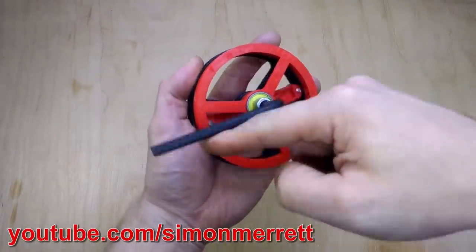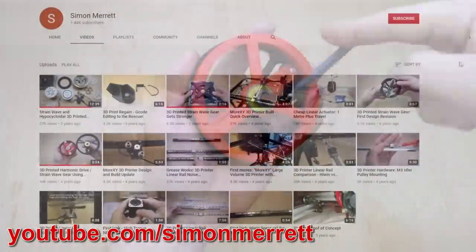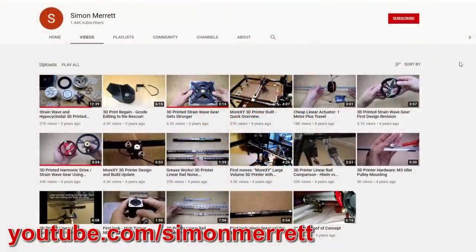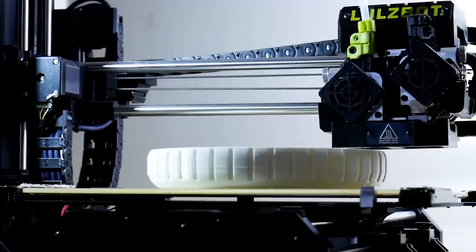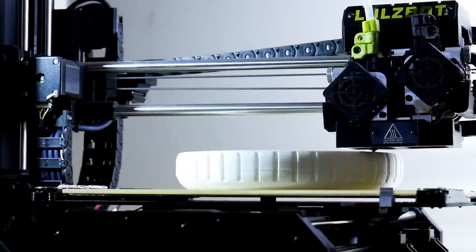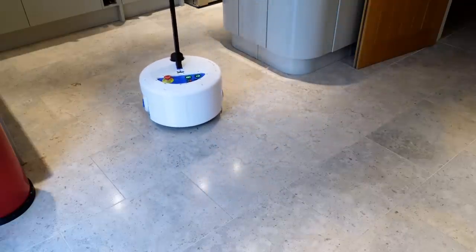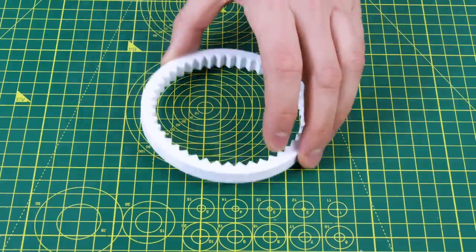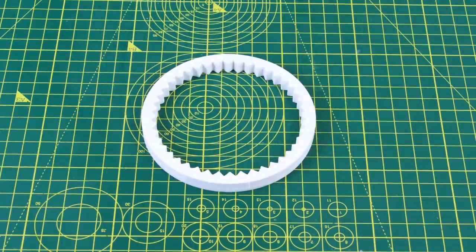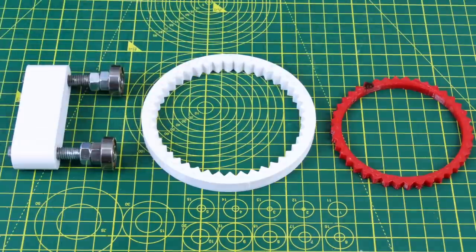Development seems to have gone as far as it could using a drive belt, and from the videos this is because the tooth profile of an HTD belt is round, but Simon comments that ideally we need more of a triangle shape for efficiency and smooth movement in general. It's possible to 3D print flexible materials though, which I've done a lot of in the past mainly to make tires for vehicles and robots. So what if we could 3D print a custom flexible spline? With a bit of trial and error I designed and printed a ring gear and a flexible spline with triangular shaped teeth and a wave generator with two bearings on it.